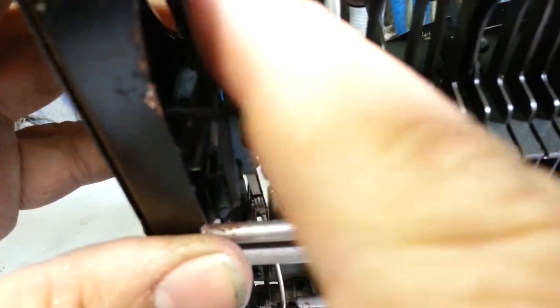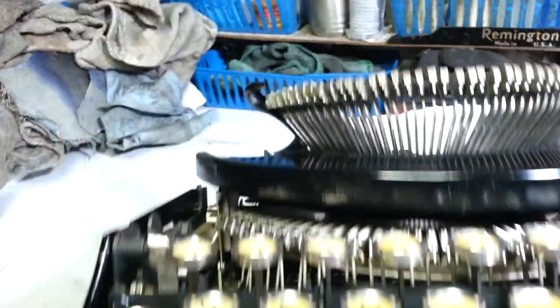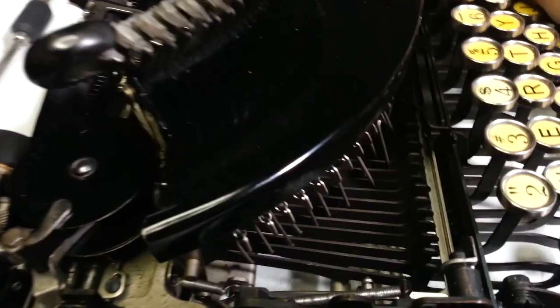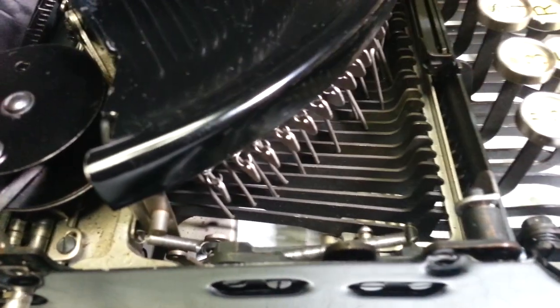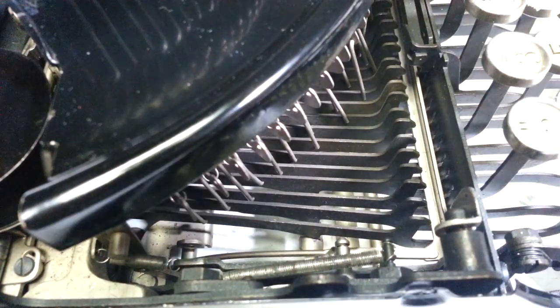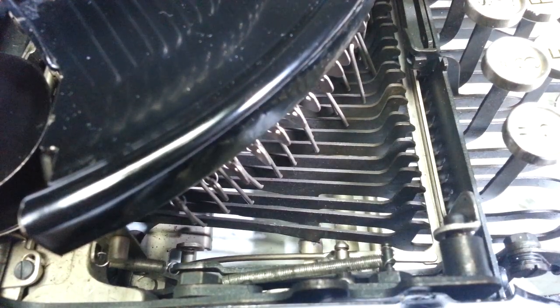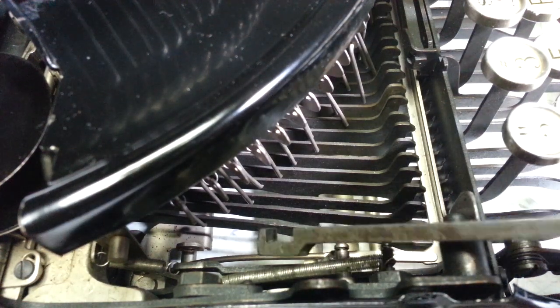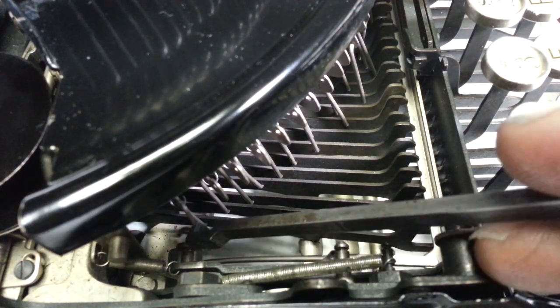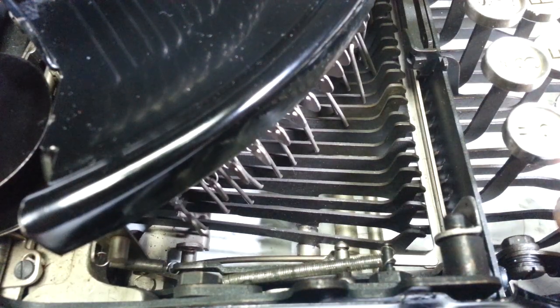I have a feeling this whole bar is bent at some point. Figuring out where it's bent is a little tricky, but I think I've got an idea. If I'm going to reform it back up, it's got to be reformed before it hits that pivot point — reformed around here, because it can't be reformed past this link, which is where the type bar is connected.